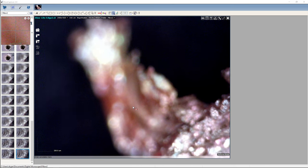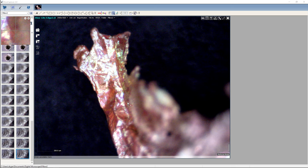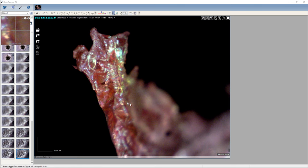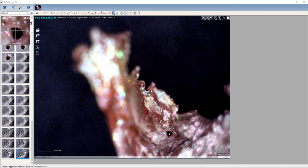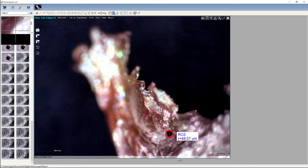And there's this section which has been thrown out, and this is quite a lot higher, so I'm having to zoom out, change the polarization so it's not so bright. This looks like cuprous oxide, is it? Cupric oxide crystals? Red. Go through the focal plane there. Interesting hole. I wonder what sort of scale that is. And it is about 100 micron, 80 micron, 100 micron, thereabouts.